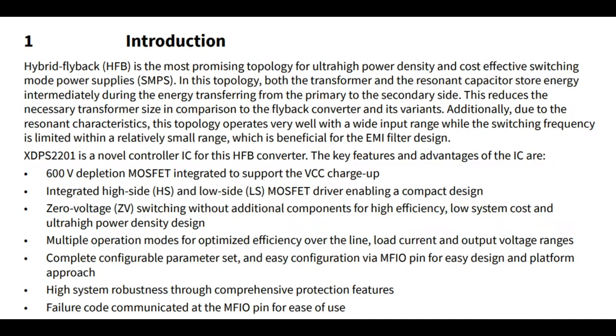It keeps track of zero voltage and zero current switching — you don't want to switch the AC on and off in the middle of a cycle, you want to do it at the zero crossing, and this chip does all that for you. It's got the simplicity of a standard analog flyback or DC-DC converter, but also enough smarts to output failure codes over a UART pin. You can also program the configuration via that pin into a one-time programmable EEPROM for setting and fixing the design.